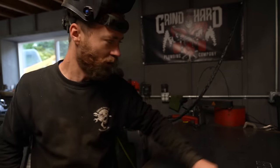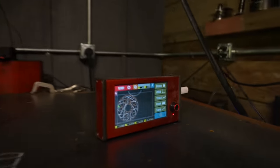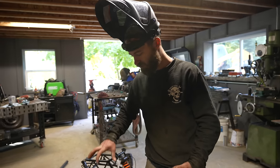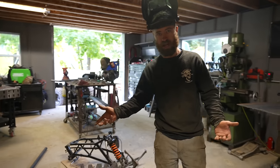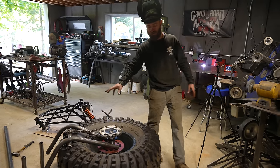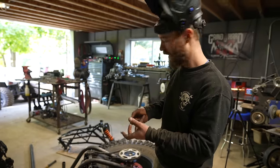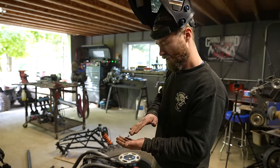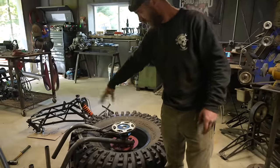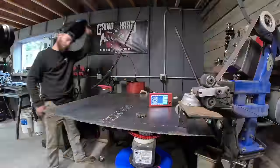A massive brake rotor. You see it right there? It may seem like an early stage for a brake rotor, but the way I'm gonna do it, it's gonna be bolted between the hub and the wheel, just like a full-size car. And then the plate that the swing arm's gonna mount to is also gonna have the brake caliper mounts on it. So, you gotta start and work my way up the stack of stuff here. You can see my mocked up pile of stuff, imagining where the sprocket's gonna be and all of that nonsense.